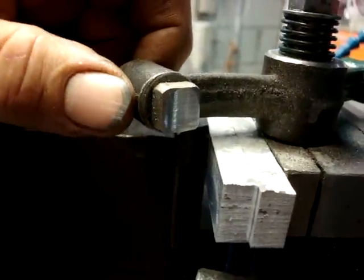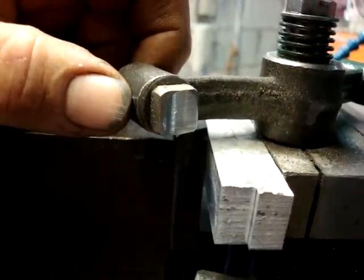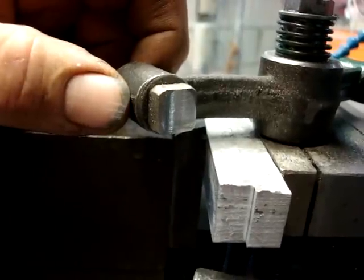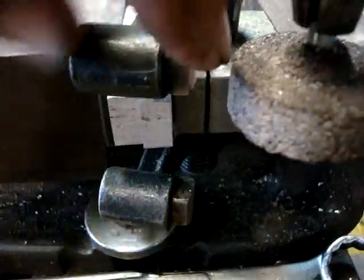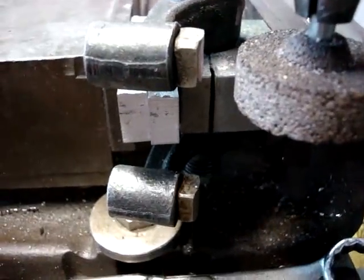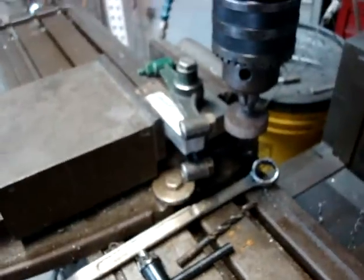It's a little rough at this point, but at least it's square. Now I'm going to true it up using coarse carborundum wet-dry paper and an aluminum block across this face, so that these two faces here will be absolutely true. It should work — the solution to one more Listeroid problem. Thank you very much.